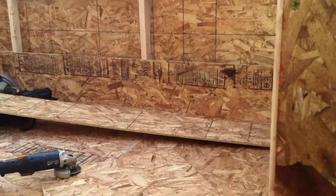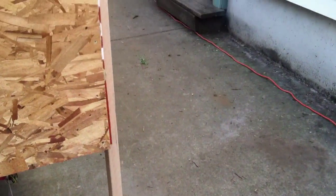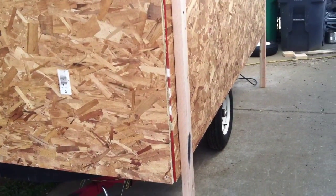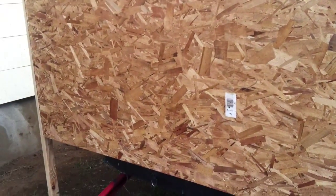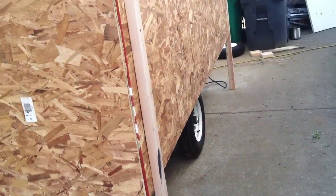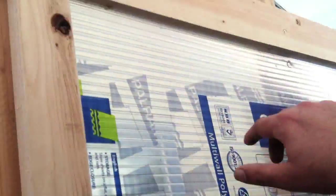Version: what I have in place are some blocks just screwed to the corners — some two-by-threes — all we're trying to do is keep this trailer from tilting as I walk around on it. It needs to be blocked front and rear, and then as it gets blocked you want to level the framework of the building. It's semi-flexible at this stage — there's no top — so we kind of level this stuff out so that as we keep going with the assembly, we're assembling at level.